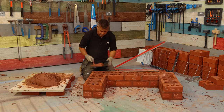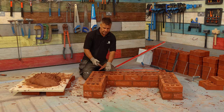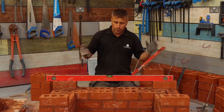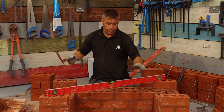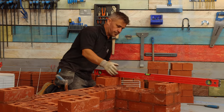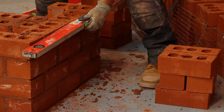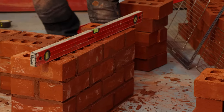That's the second course now complete. Just going to infill between the centre and end bricks to strengthen it up. Using your spirit level, check all four corners to see that you're happy with the second course, then you can start the third course. Once you've got three courses up you can start your fourth course by bedding a brick on each corner, transferring the levels across, making sure it's level on all four corners. It's a little bit like a house where bricklayers build up and stagger up each corner, then run a string line in and fill all the bricks in between. When you've got your corner bricks set into place, use the edge of your spirit level to make sure they're flush - level along the top, flush along the back and sides, and level across the top.